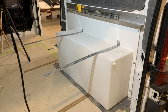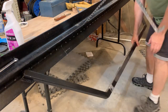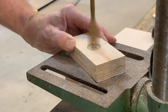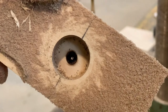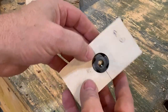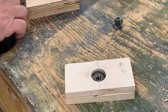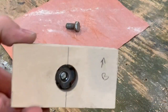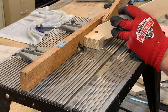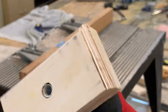The wall is back installed and the two 36-inch long slotted galvanized metal strips are beginning to take shape. Back to the bending break for our second and third bends. Just like the mounting to the wall, I want to be able to bolt the tank to the floor. I have glued two pieces of half-inch Baltic birch together to make a 1-inch solid piece. I am now drilling into the underside to countersink two floor-mounted 5/16ths T-nuts. Since these blocks will be floor mounted, I want to smooth over the top edge to reduce the chance of injury if you bump into them.